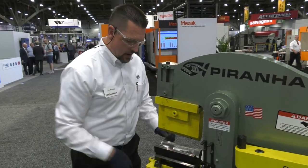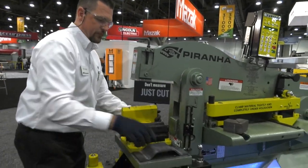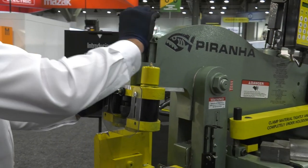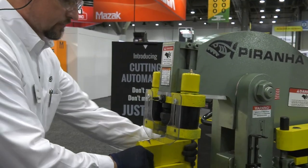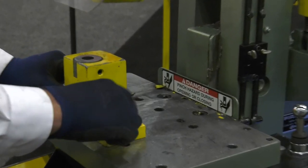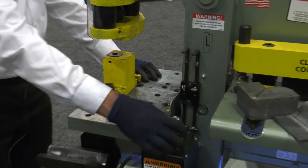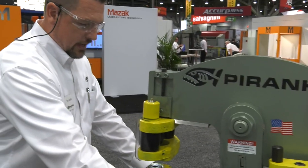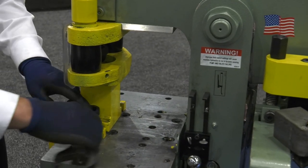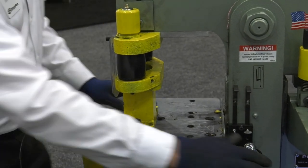When you're ready to get some holes in stuff, we'll turn that off, get this stuff out of the way, and go back to punch some holes. You just loosen up that, which lets the shoe drop down and it slides off. Turn on the four-way for the die block and the stripper assembly. That dovetail slides right on at a positive stop so you're back in position — a quick lock ties it down. The die block's the same way, with set screws that come in for indexing against the studs. You always want to double-check and make sure you're lined up. Fast and slow with the joystick here so you've got full tonnage and full speed, or you've got jogs — so if you're setting up tools or doing something small, you can ease it in to check your alignment or do small work.